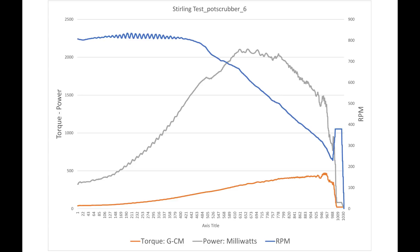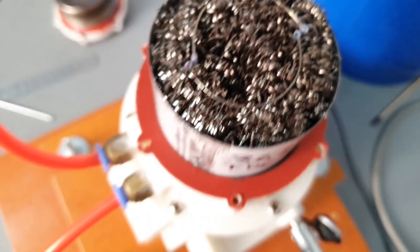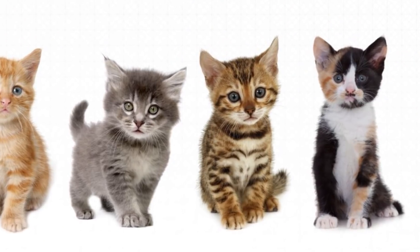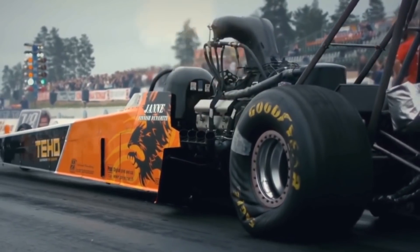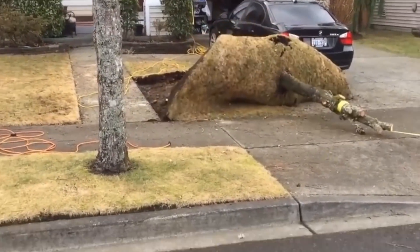The engine is more like a tugboat engine. We now have a much cleaner output graph without all this peaky crazy stuff going on. The only thing weird is right at the end where the engine stalls and the tachometer signal gets tricked into thinking that the frequency has risen because the engine kind of oscillates back and forth instead of turning. If we open up the cylinder head and look at the regenerator, we can see it's in really good shape — it's barely oxidized and looks like it could run like this all day long. Very nice, except it's kind of boring, especially when you consider that the peak power output is a pavement-scorching two watts delivered at 500 stump-pulling gram-centimeters of torque.